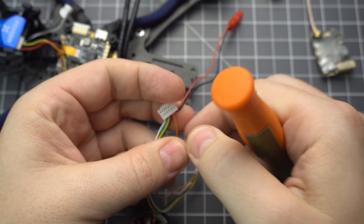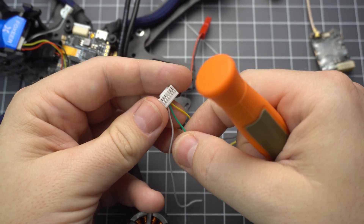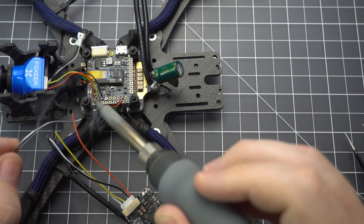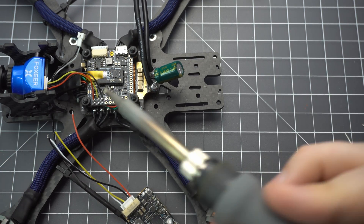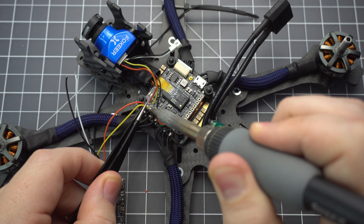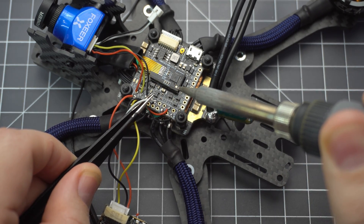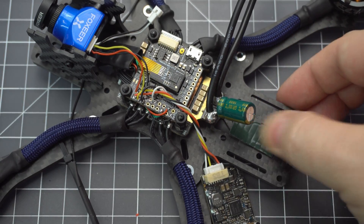Next let's move on to the VTX. We don't need a few of the wires — we're not sending power from the VTX to the camera so we can remove the 5 volt and ground there, and we're not going to use a microphone so you can remove the audio. That just leaves us with 4 wires: voltage in, ground, video, and smart audio. We're going to run the VTX from the B+ pad, which is basically just the battery voltage — unregulated, full voltage from the battery. This VTX can take up to 6S so that'll be fine. We're also going to solder the smart audio wire to the TX6 pad and configure that in Betaflight. This is for controlling the video frequency, band, channel, and power output over the OSD in your goggles. Twist the wires up to keep things tidy and add some double-sided tape to the bottom of the frame to hold the VTX in place.